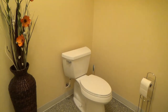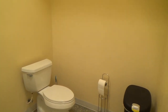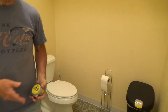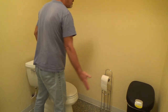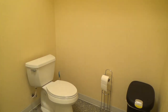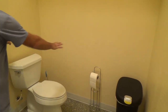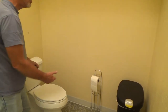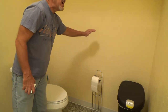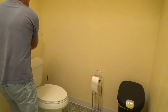All around the toilet you have to have a washable surface. Sheetrock is not considered washable — even if it's painted with semi-gloss paint. If you got a permit and wanted it signed off, the building department won't allow sheetrock. You have to know these things up front, read the plans, and understand the requirements when you get your permit. If an inspector comes out and you don't have paneling — like Marlite or FRP paneling — you'll have a problem.